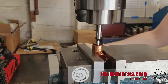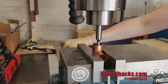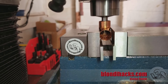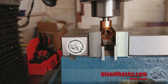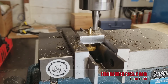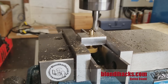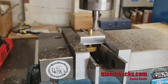Over to the mill now to first prepare the copper elbow. Using the edge finder, I can find spots on all four sides of the copper pipe opening, and once it bumps over I've got the edge. Now that we're nicely centered I can go ahead and make that cut downwards. You could do this with an end mill but not with a drill bit, because a drill bit is not rigid like an end mill — a drill bit would walk all over the place. Our last operation is to make the screwdriver tab on the end of the knob that'll key into the thermo switch. I made a quick and dirty fixture to hold the knob for that operation, with a slot cut on the far side for compression.